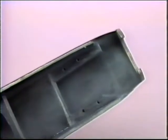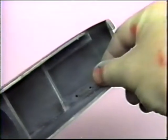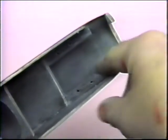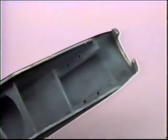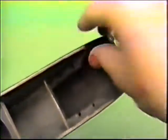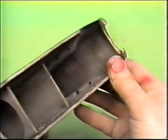With one piece removed and the motor back in, I'm trying to find where the pad ends — I don't want to go any further than that, and I don't want a stress riser; I want a nice smooth transition. That worked out well, and that got us off a little more than a quarter of an ounce. I cleaned this all up with M600 — you can see it's still wet in there.